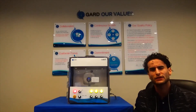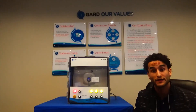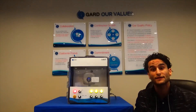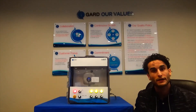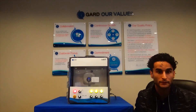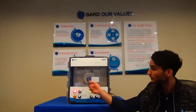The process of establishing an electrically safe work environment involves a particular series of steps. First, verifying that the tester is working with a known source. Two, verifying that the conductors are de-energized by measuring phase-to-phase and phase-to-ground voltages. Three, re-verifying that the tester is working. One of the benefits of employing the iAVT is that it performs all of these steps automatically with the push of a button.